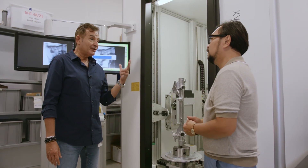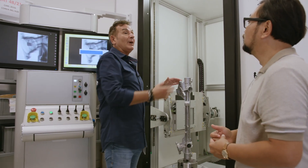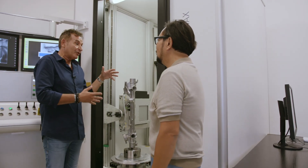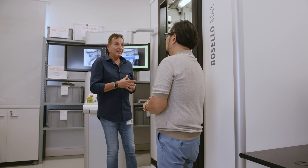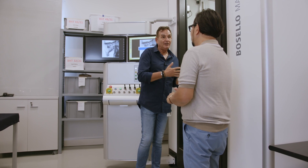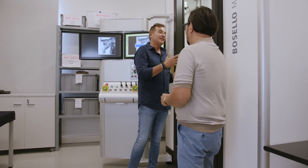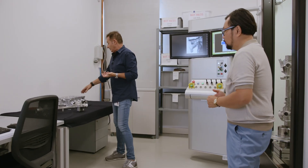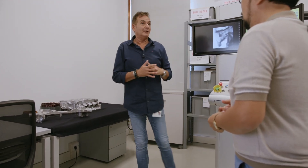We have this system available in three different sizes. With this size you can check parts up to 1.5 meters in length — for larger castings. We also have a smaller one and a bigger one. Then we have to talk about power. This is aluminum, which is easy to penetrate — 225 kV power. But if you increase the thickness or change to a material with higher density, we have to move to higher power. With this one you can also check this cylinder head, which is bigger and thicker, without any problem.